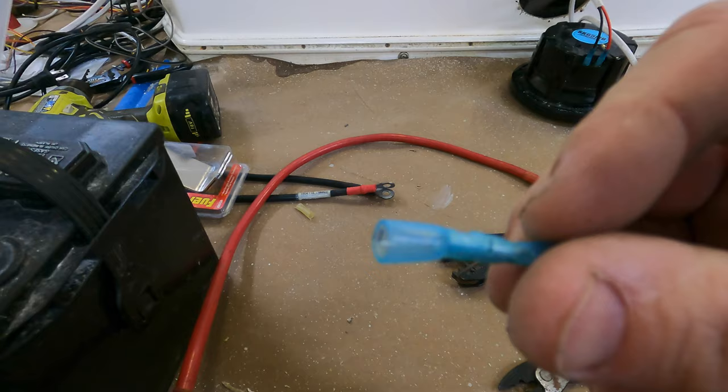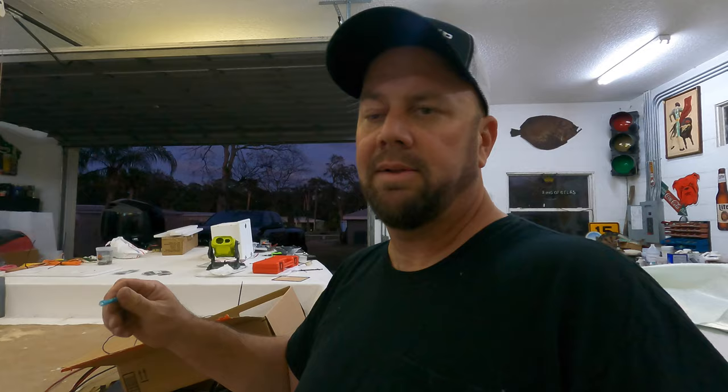That's the main thing, is you want to pre-rig everything to where it doesn't rot. You want it to last for at least like 10 years. The only way it's going to do that is if it's totally sealed from the elements. You don't want to be putting holes in the jackets of the wire or the heat shrink connector. It's just gonna rot it out, eventually turn green when power's running through it and it gets a little bit wet or gets some moisture on it. Just a recipe for disaster. You're gonna be fixing it later.